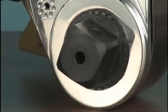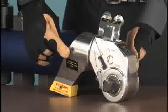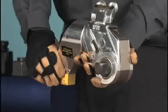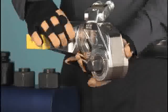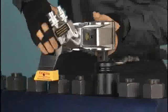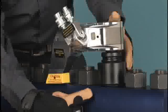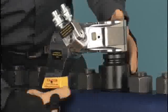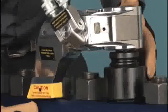Each wrench is designed so that it will not break its own drive. This is the reaction arm, which blocks against a solid surface to keep the wrench from rotating as the socket turns. It is easily adjusted with one hand to reach the blocking point. The rule is to keep the arm pointing generally in the same direction as the drive, so that the force applied to the socket and the resulting force on the reaction arm stay in the same plane to minimize rolling or side-loading of the wrench.